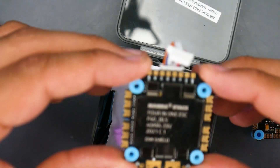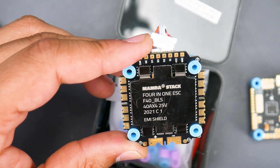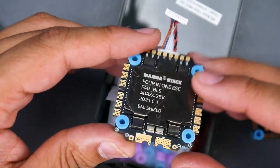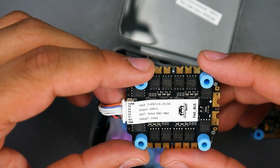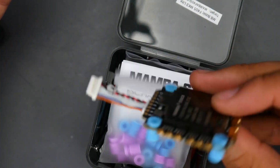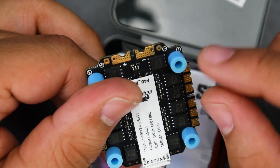Now these ESCs are an absolute beast. This is the F40 — 40 amps, compared to the F50 and F60 I've tested before. It's a slightly different one; maybe the electromagnetic interference shield was added because they noticed something. I wish the shield quality looked a bit nicer, but who cares — as long as it performs. Specs: 3S to 6S input, 40-amp output, DShot 600, BLHeli32 for RPM filtering. You also have pads broken out in addition to connectors, and connectors on both sides.